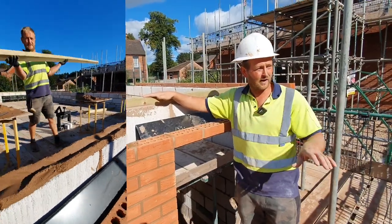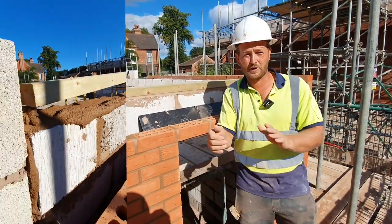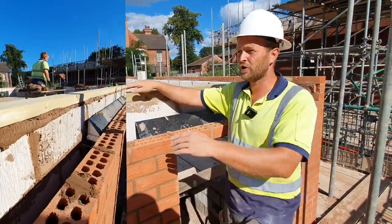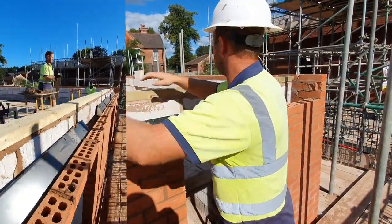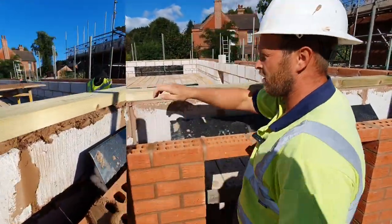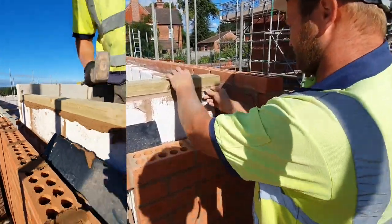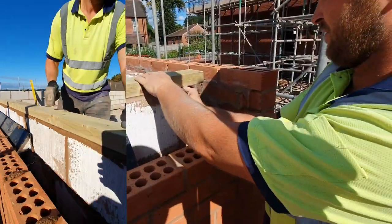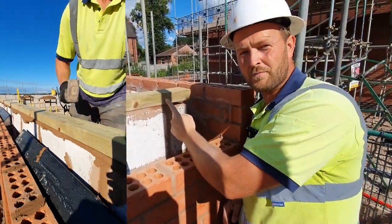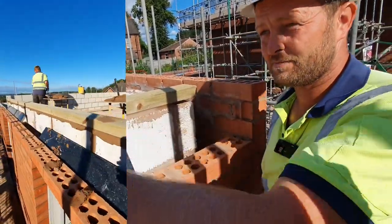Wall plates go on — use your four foot level, go across with your lump hammer, not your trowel, because you won't get it down enough. Make sure that when you cut these, all you've got to do is lay it down on the floor inside, lay this one lapped over it, go past 100mm, cut it off. The reason we leave this past 100mm is that shouldn't have any pointing in there — I left that short for a reason. We leave this long 100mm.